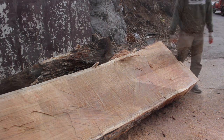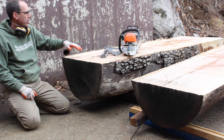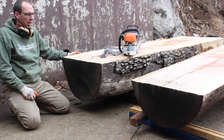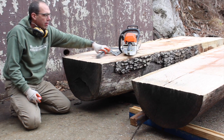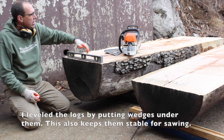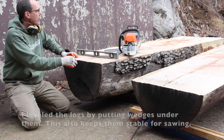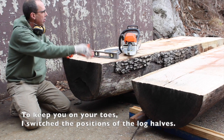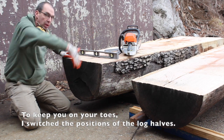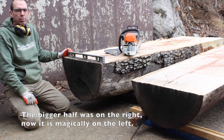Looks really good. I've got the logs cut in half and set up here off the ground up on some blocks. And I took the time to level them out a bit. It makes it easier when I'm going to cut these. Generally, when I'm holding the chainsaw, I kind of wanna be plumb. And if I got these level, it just makes it easier. It just naturally goes to plumb. So,